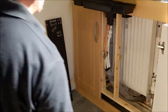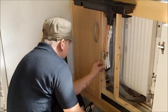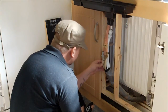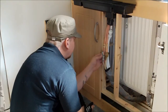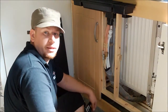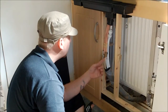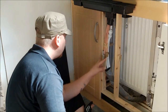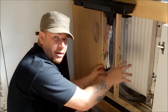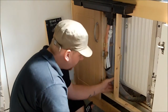The next thing we have to do, now the taps are open, is to detach the pipes one by one. There seems to be a little bit of beer flowing in under too but that's not really a problem. I'm going to grab a spanner because some of these are push fit and some of them are compression, and we'll change out the ones we want to change. In fact I'm going to take it all off and push it back through the wall because we're going to be changing all of this section — this is the beer python here, and we're going to be changing all of that.